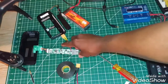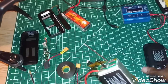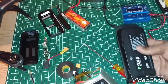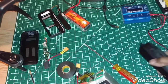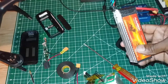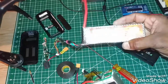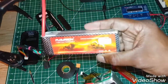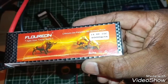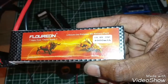This battery particularly — one of the things I was wanting to do for a while is to see what happens if these batteries are no longer available, or right now they're not making them anymore. So I want to be able to have a backup and be able to use a regular LiPo battery with the Solo, and also be able to see the data off of the four cells — a 4S battery. The particular battery I'm going to use as an example is a 14.8V 4S battery, 25C at 4,000 milliamp hours.